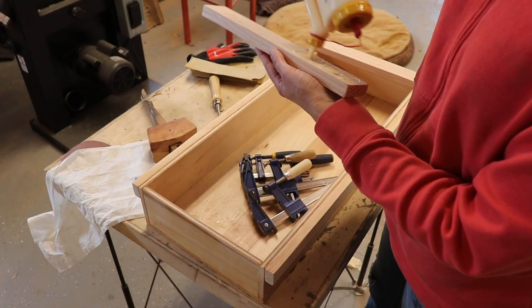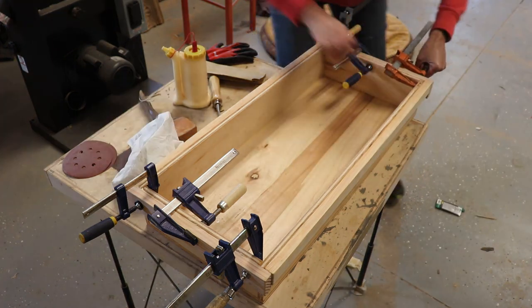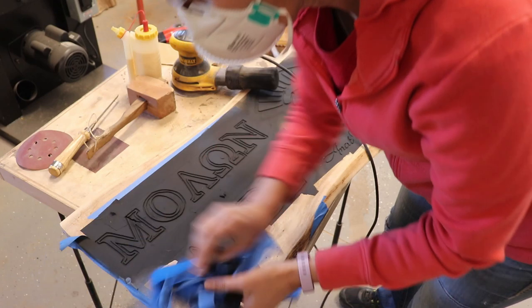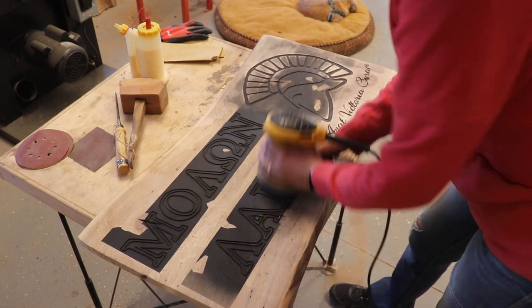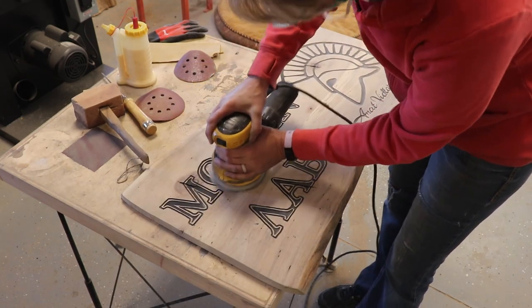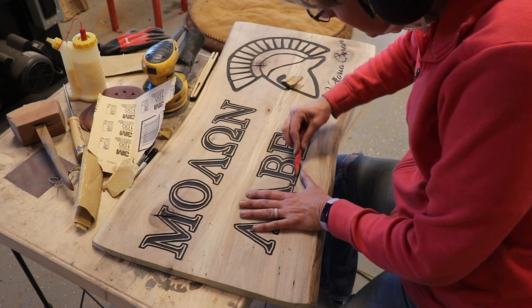I had to add some more wood to the sides because I changed the design from sliding to the side to sliding down — I'll explain that more in a bit. After the primer was dry, I removed the tape and started sanding away, first with 60 grit, then 80, then 100. I went over areas again with the stick sanders.